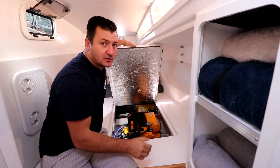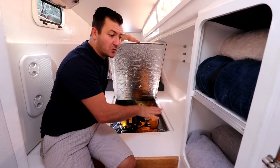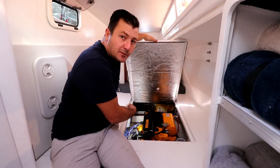It's a bonus — we only need to carry one kind of oil. The guys really thought about that, and it works fantastically. There's a bilge pump in here dedicated to this compartment. This compartment can also flood completely by itself and we wouldn't spill over because we are above the waterline on this top layer, and all the ports are sealed — so if it flooded, the water couldn't flow to the rest of the boat. It's almost like a separate compartment within itself.